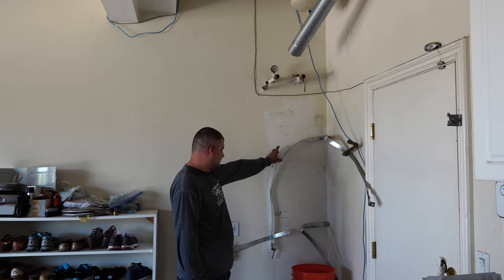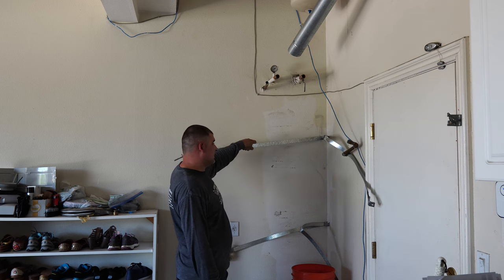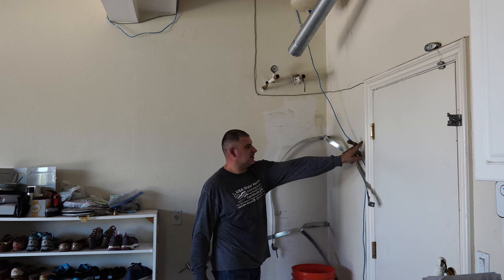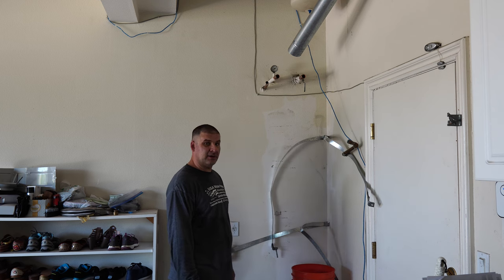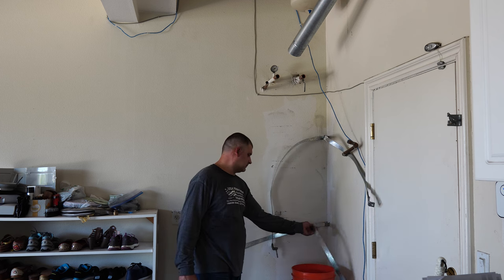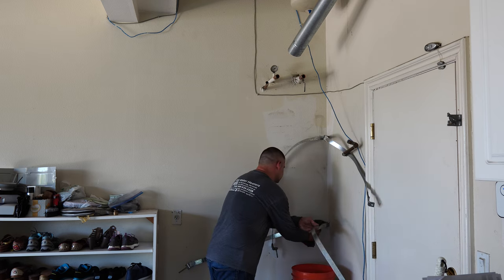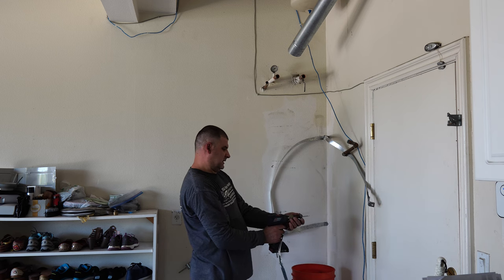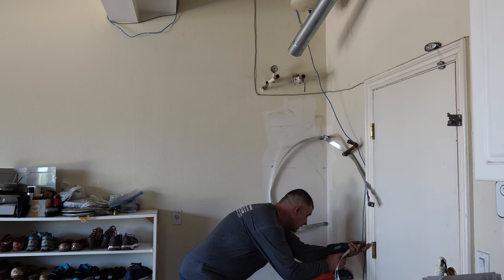Fittings there. Next thing, straps. Have you noticed? Both straps drill into the same stud. That's not right. So I'll keep one strap right here and the other strap will drill into the stud somewhere right here. So you should have two separate points of bracing, not the same stud in the back. I need to find the stud here. There's always studs around doors, so it shouldn't be a problem. Just like that.